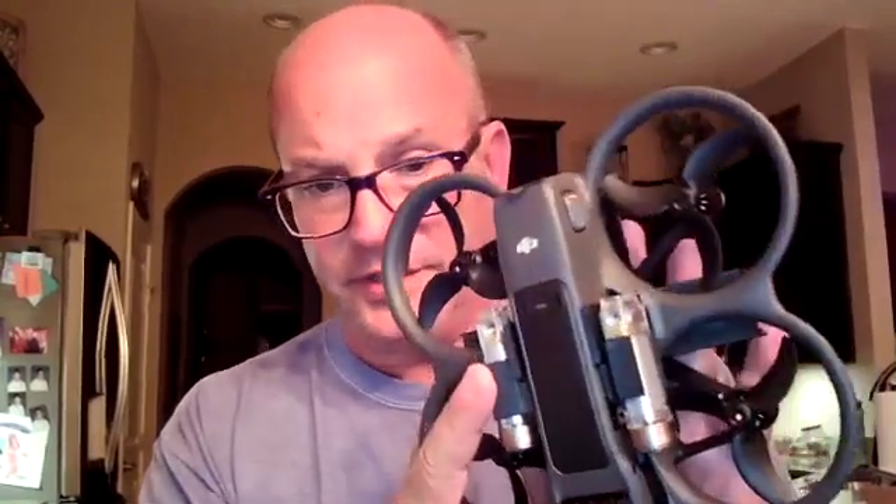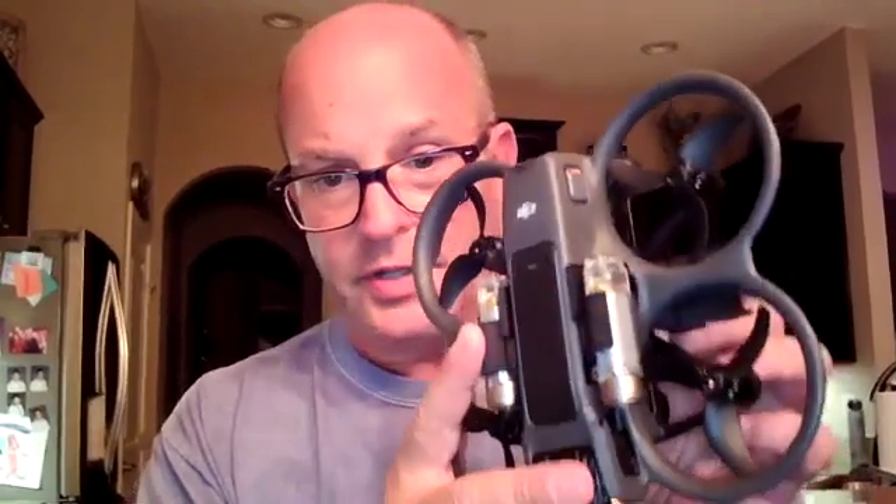When you do start setting the screws through, you will meet some resistance on the front half until you get all the way through, but the set screw on the bottom should seat properly. Don't over-tighten them — if you have a Mongo on your team, don't let Mongo put this on. It doesn't require that. Snug it down good; the vibration will take care of it. If you want to put a little Loctite on it — the releasable kind — so be it. These are 3D printed parts printed generally in PETG, which is a really good material that takes a beating pretty well. If you do manage to crack one, give us a shout and we'll get it replaced for you.